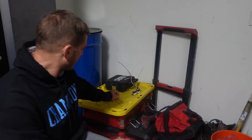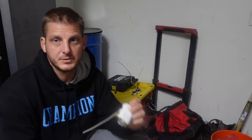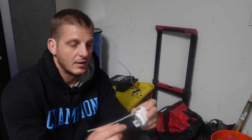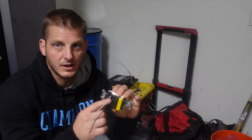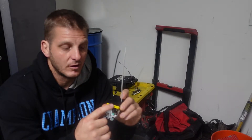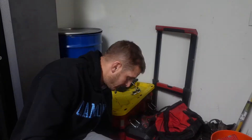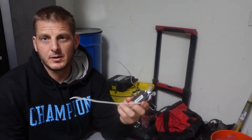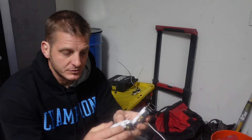There is a solution: a GFCI set up on the line side only — unless you have other outlets being protected, in which case you have to identify those outlets as GFCI protected. The wire that provides power off the breaker goes to the line side; wires coming off the other outlets go to the load side so they are protected. You can do this setup as long as those outlets are downstream from it.